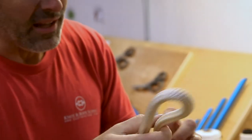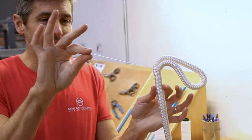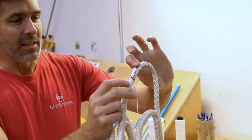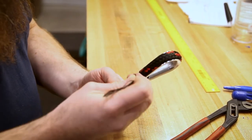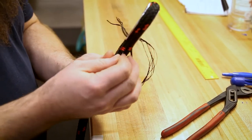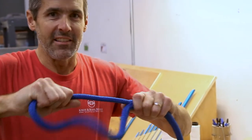Obviously we don't want that. We want the splice to stay intact, so to do that we would stitch the splice together. What we do at Knot Rope Supply is a neat thing — it makes the stitch very strong, very durable, and very safe. The process will actually leave one strand of the rope out, and that will help us mark where that splice needs to come up and finish. Once we get to that point, that strand will be sticking out, we know the splice is in the right place, and then we'll attach a needle to that and stitch through here multiple times. Once that's done — and I have a finished piece right here — once that's stitched, there's no way to pull that back. It's locked in there safely.